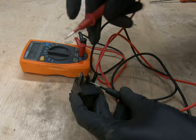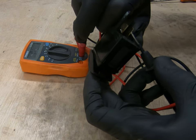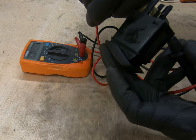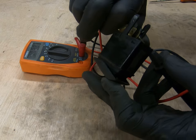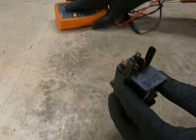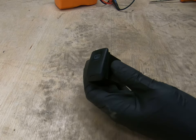I'm going to do it without clips. With the switch closed, I'm getting nothing. But if I rock it back a bit, it's beeping. So that's the switch closed, that's the switch open — with it halfway rocked closed it's beeping. It's showing me that when the switch closes, it's not really closing properly, which could be corroded terminals, bent terminals, whatever. So we'll open this up, pop the top of the switch off, hopefully things won't go everywhere, and then we'll be able to see what we're doing.